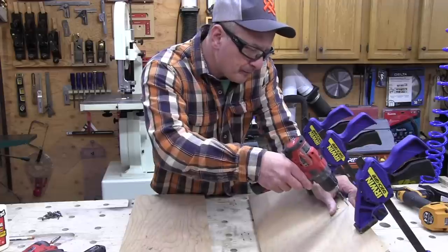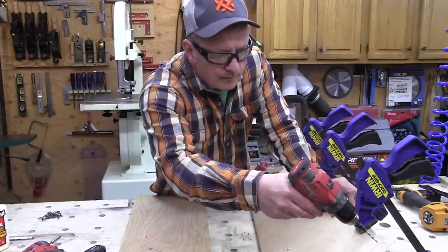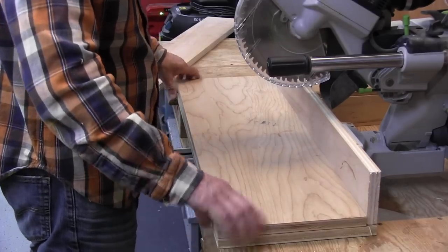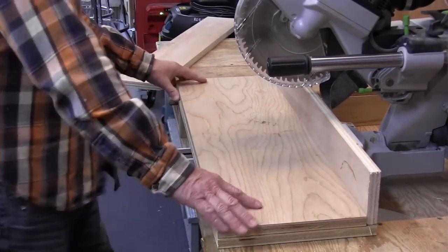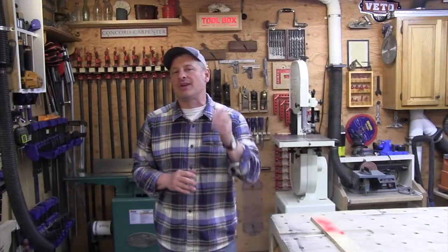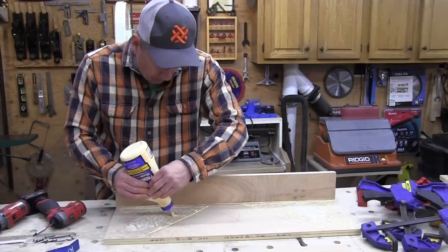The third step is to add the angle guides. I add a second layer of three quarter inch plywood to the bottom of that jig base. When I do that, I make reference marks for setting the fence on the saw as well, so it can be clamped in place and I can align it quickly every time. Here is where you can geek out — make the fence longer, add cleats on the back so it slides or locks into your aluminum fence, or use thicker wood for a deeper, larger angle guide.